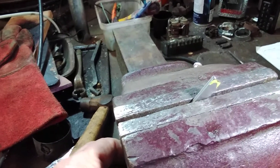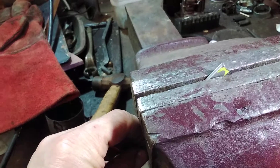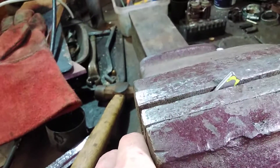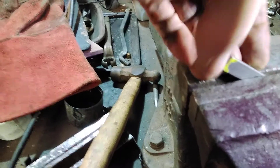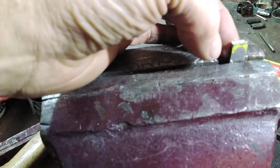To cut the curve, you don't want to put your work piece in vertical. You want to put it in at an angle, nice and low down, and just deal with taking the corners off that curve first. You'll see me take the corners off the curve, then I'll put it in the vise the other way round and file the other side off, and then I'll put it vertically in the vise and actually profile it to a proper curve. So you'll see those three stages happening.